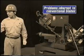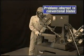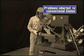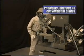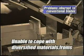Yet in reality, it is a nuisance to have to change or break in the saw blade, and so many operators stick to blades with relatively small pitch that provide flexibility. So this means that they are sacrificing cutting speed for convenience.